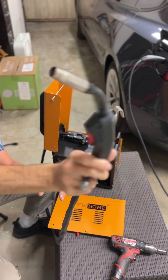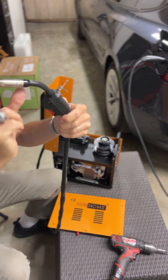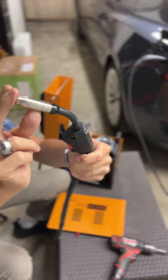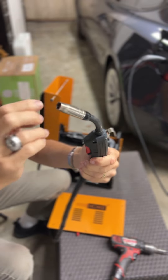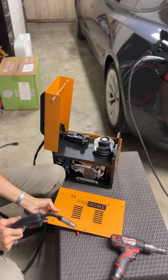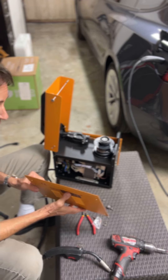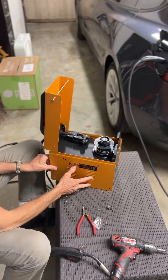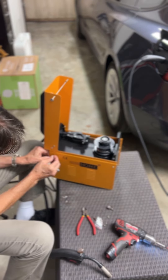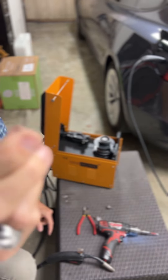When you do your work so this doesn't happen again — if you're welding, keep your work about this far away and you'll be fine. When you get in too close or you're in a tight spot, that's when you get blowback and the tip can get welded into position, which is going to burn out your motor. Before you even do this procedure, first thing to try is just let your welder cool down for about half an hour and fire it back up to see if you've got function back — it could be that it's just overheated.